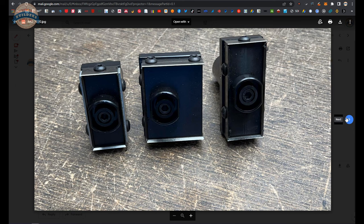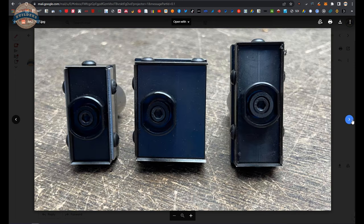Well, you could do a T-strike, a 2 3/4 T-strike in a wood frame. You could do a 4 7/8 strike in a wood frame. Yeah, if you're doing a mortise lock, for sure, you're going to have a 4 7/8 strike there. I don't believe strike marking tools exist for 4 7/8. They may for 2 3/4. I think there's a company called Bighorn that may make those. They make lock installation tools, but they are at the opposite end of build quality compared to Major.